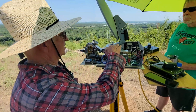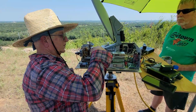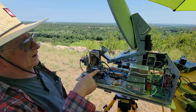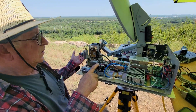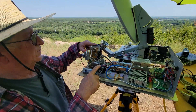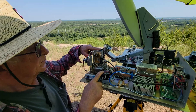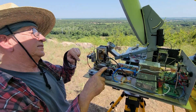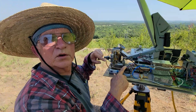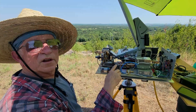This filter takes the second harmonic and lets it pass through. From there it goes into this transfer relay, which switches it either to the amplifier — this is a 1-watt 10 GHz amplifier — or to this LNA, which is a 2 dB noise figure, 20 dB gain, 24 gigahertz LNA from Infinity Electronics.